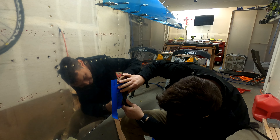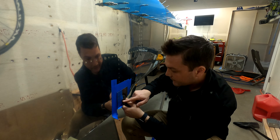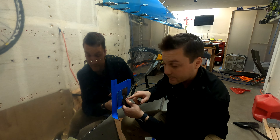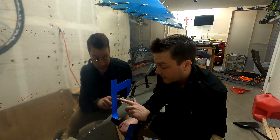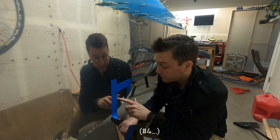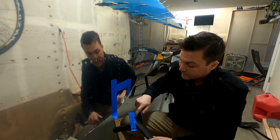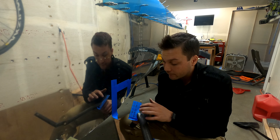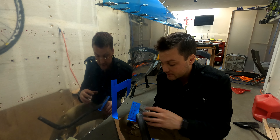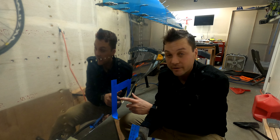It's fitting pretty well and I have all of my holes drilled aside from two here. This hole was really, really close to this rivet, so I've decided I'm going to drill this rivet out, enlarge the hole for a number three rivet, and line these two rivets up with where that hole is — combining the attach rivet for this and the skin rivet. It shouldn't be a problem and it's going to allow for the exact spacing I'm looking for on the exterior of the plane, so you don't have a rivet hanging out in no man's land.